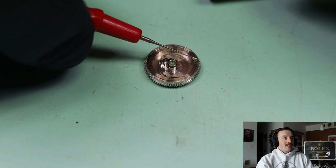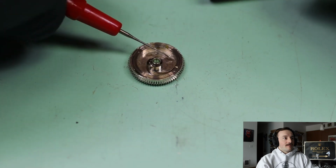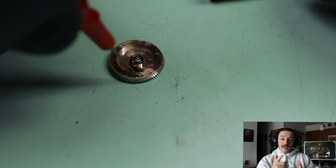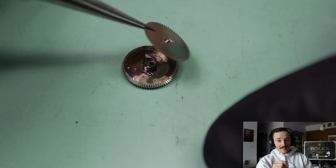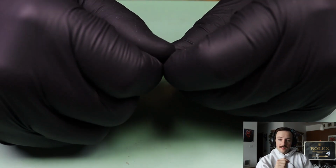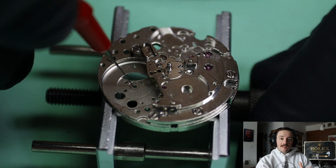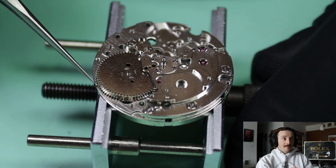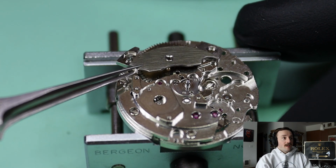So Mobius 8000. And now, before I installed the mainspring, I had forgot to lubricate the inner wall of the mainspring barrel, and so you'll see right there, there was just a small slot where there was an opening to that inner wall, and so I put some 8000. So when that mainspring gets fully wound and it begins to slip doing the automatic slip, it'll have oil on it so that it doesn't bind and doesn't cause a bunch of wear.